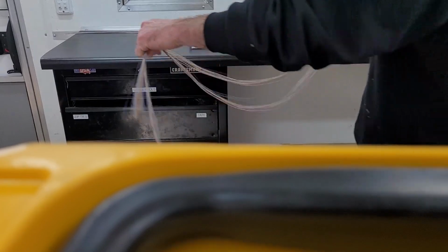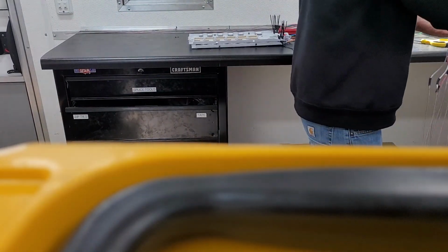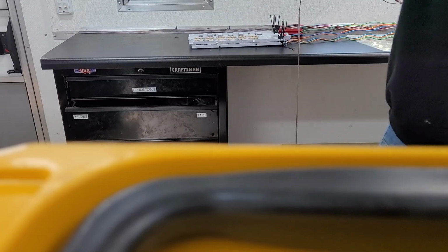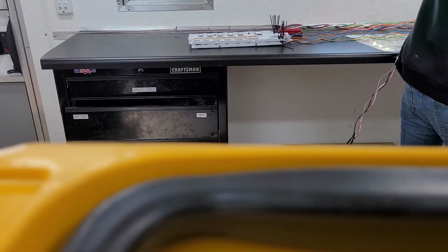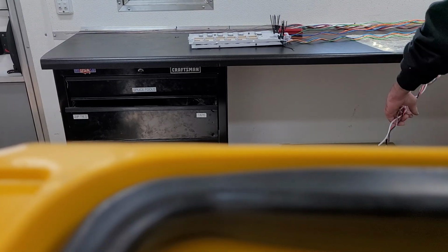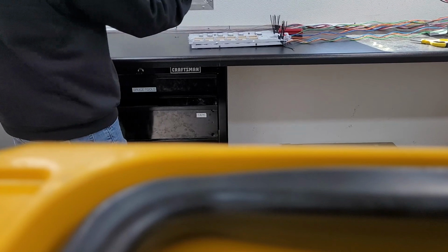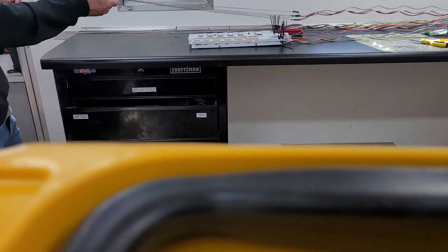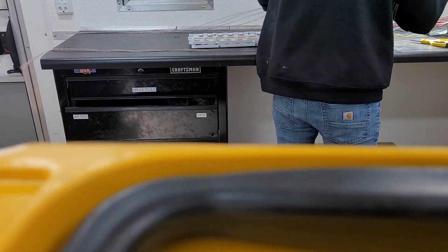Right now, I'm trying to get the next four tubes. I like to do them in order. So next, I'm going to get slate through black. So it's slate, white, red, black. As I said, don't freak out if you step on it. You totally just stepped on the fiber. The bare fibers. Kind of rolling my fingers through them, like I was talking about earlier, before I take the time to anchor them all with a tray, because on the first set we found one was broken. Okay, so those four appear to be good.